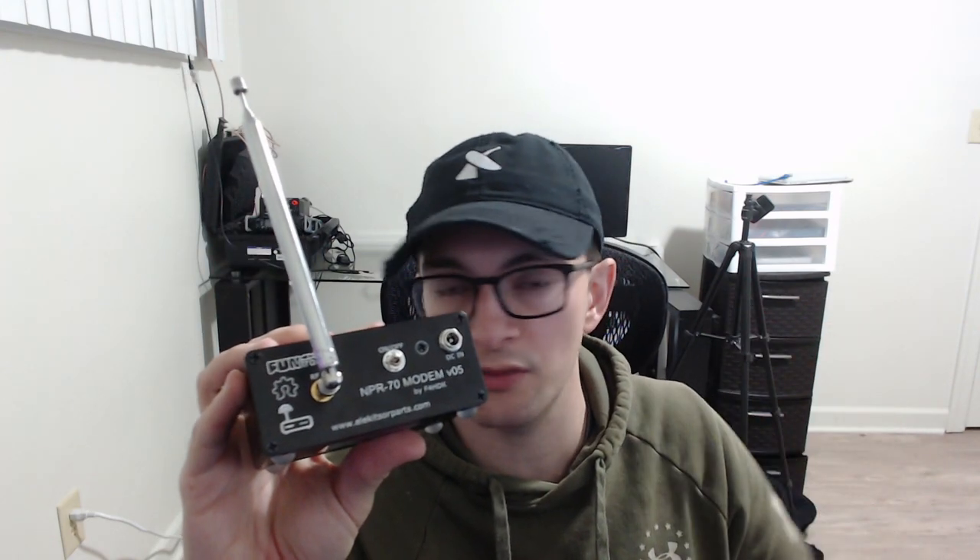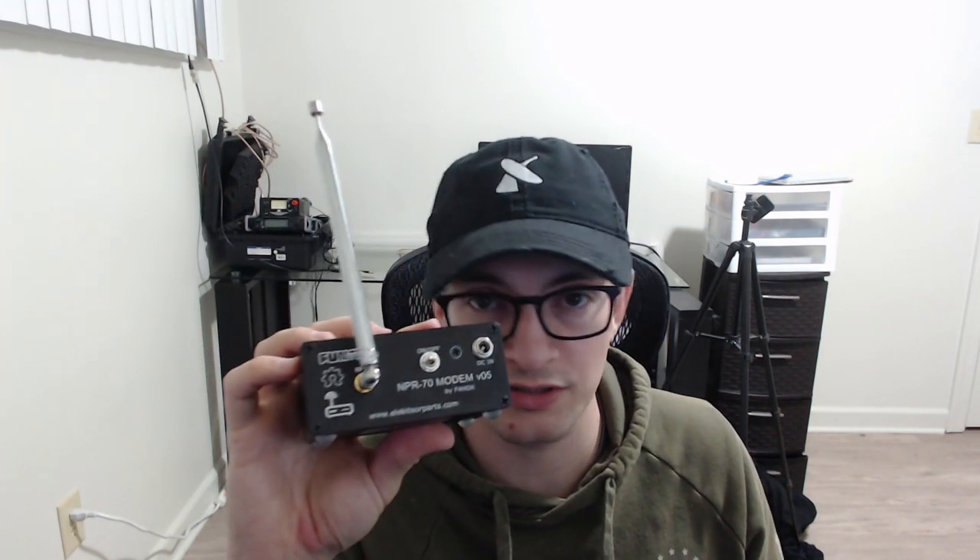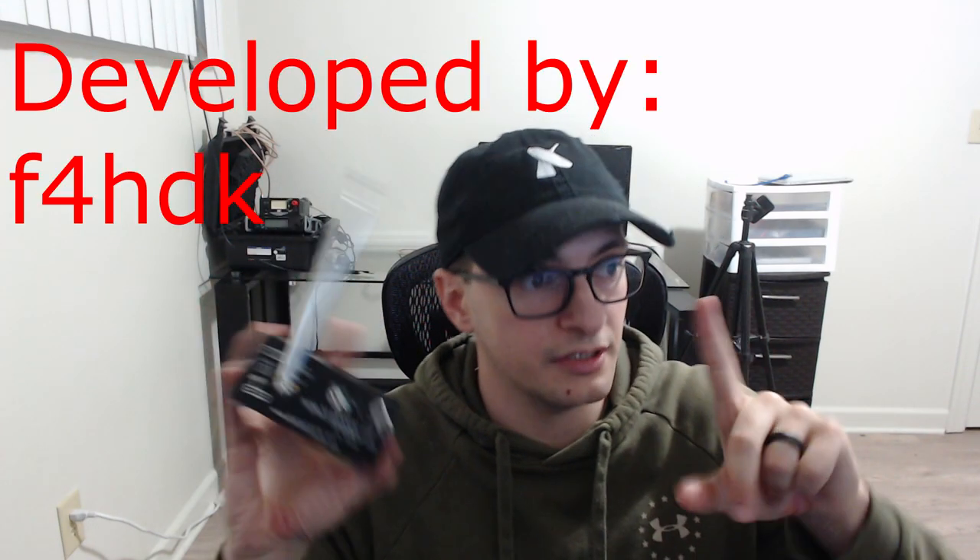You want to use 12 volts on the power connector. That means you can connect any basic 12-volt lead acid battery, lithium ion pack, or a ham radio power supply. A higher quality power supply will give a cleaner output signal and less electromagnetic interference. That's the base model.